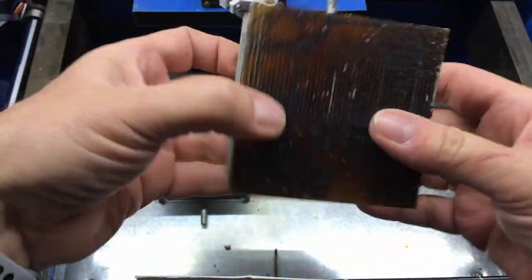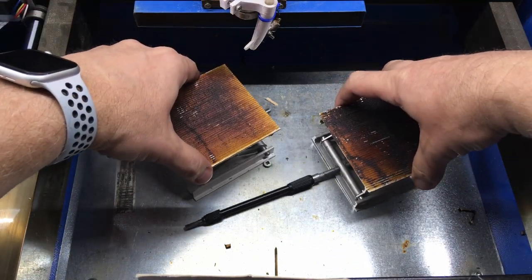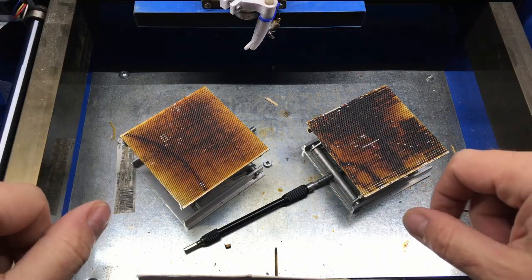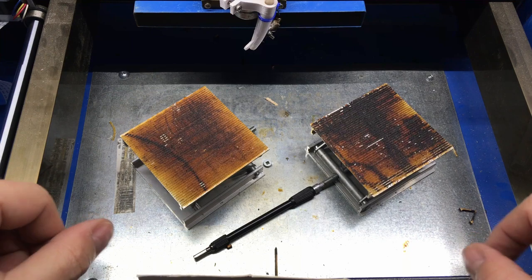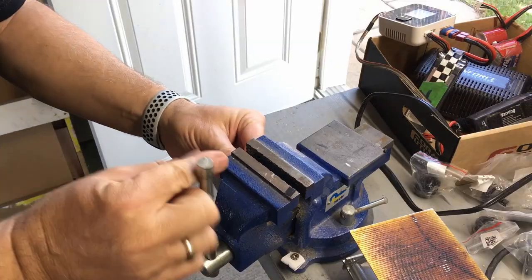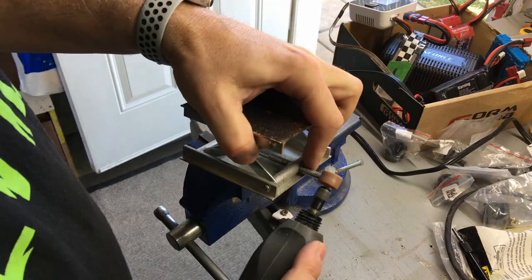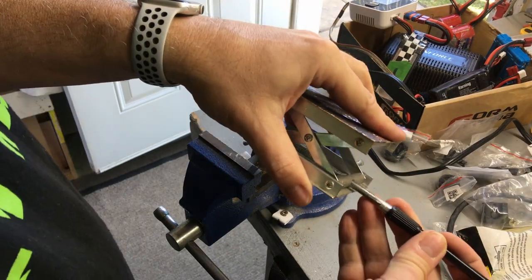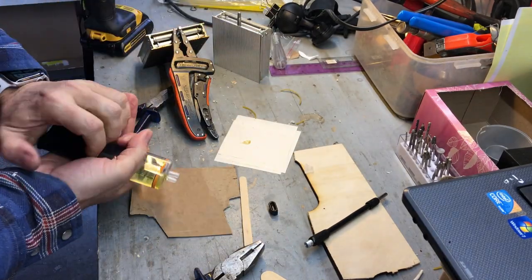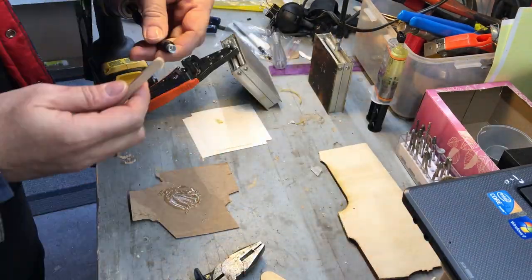If I want to place the lifts back on the bottom there's another problem — I cannot fit them flat, so I decided to place them at an angle. I have to design a kind of support to allow me to place them and remove them easily if I need to clean the bottom of the laser. First I have to drill the extension to make it fit and then grind the shaft so it fits perfectly. After grinding the two shafts and drilling the two screwdriver extensions I was ready to apply the epoxy glue to fix everything together.